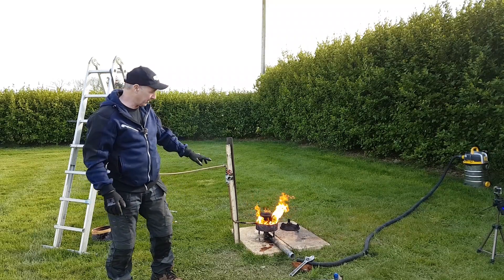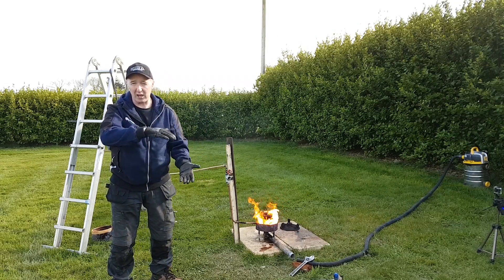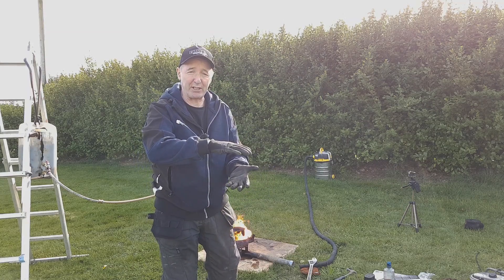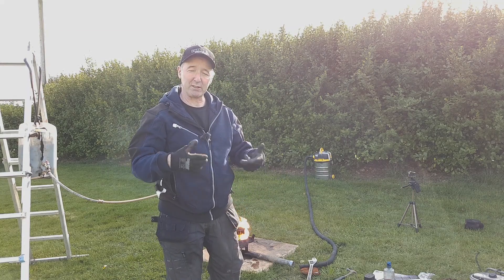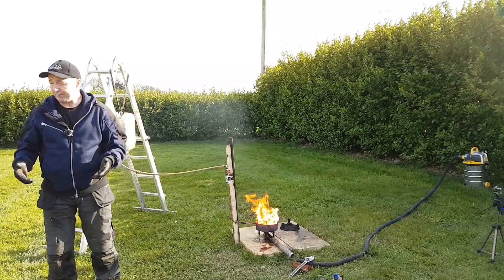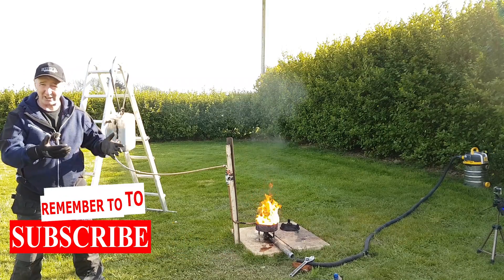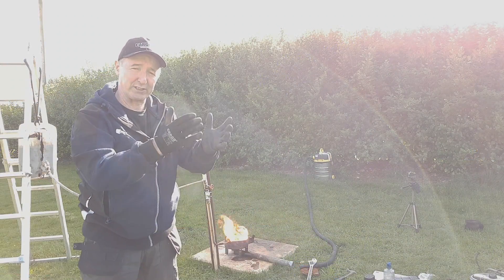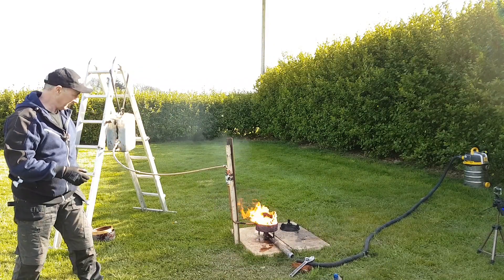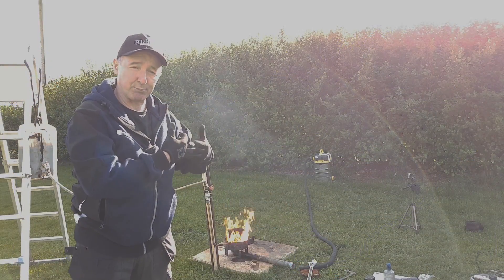When it gets going, I can put that other piece of metal on the top — just as a compressor of the flame. What happens is the flame gets compressed, it heats everything red hot, and because it's red hot the new oil going in vaporizes. It's a bit smoky at the moment, and that's normal because it's outside — it's getting air from all directions. If it was inside a little stove, the only air it gets is the air we provide. The hotter this thing gets, the less smoke it makes, because everything gets burnt up in that heat.